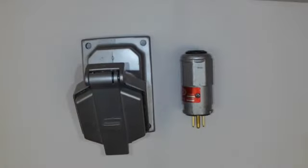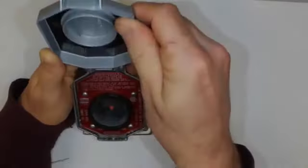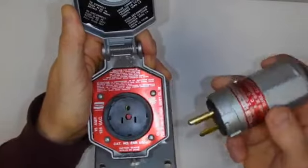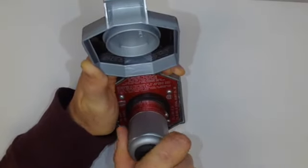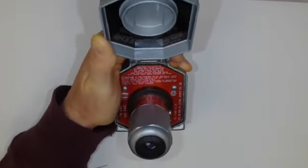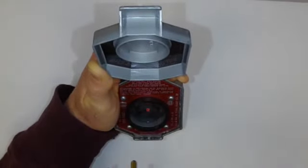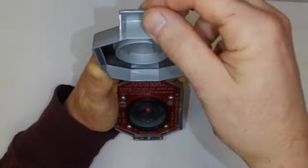There are other types of equipment utilized for explosion proof applications, like this receptacle and plug assembly, which would fix on top of one side of that gangable enclosure. It's a little unique because it has a spring-loaded cap. To use it, you insert the plug first, then push it all the way in and twist it. Once twisted, the cord coming out from the end of the plug is energized. To turn it off you have to twist and remove — so it's a locking receptacle, but it also controls when the plug is energized, which is different from a standard locking receptacle.